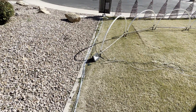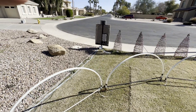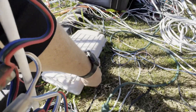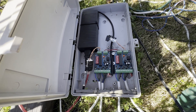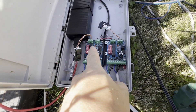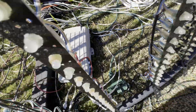In the front yard I also have some 50-watt floods that I reverse engineered. I bought a four-pack on eBay for about 80 to 100 dollars, removed the power supply and infrared system, and hot-wired directly to the chip on the board. I run them all off a little ten-dollar Amazon DMX controller inside a box — each controller drives two floodlights — with a 12-volt power supply. Those DMX boards actually go from 5 to 24 volts, so you can match any power supply to what the floods need.